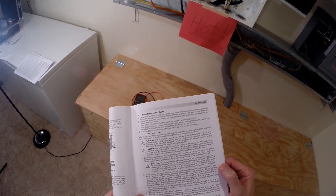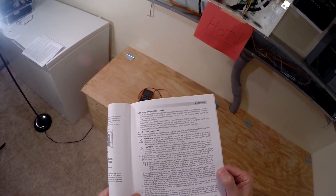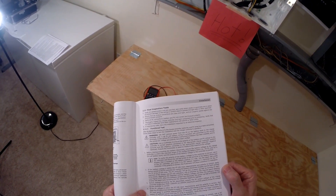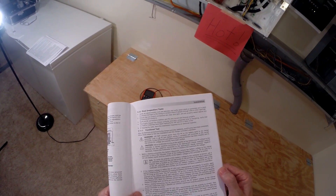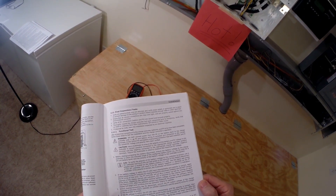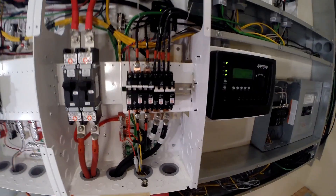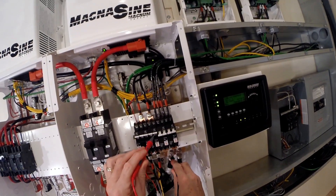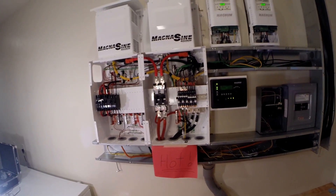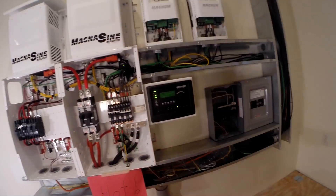From the manual: if the battery voltage, input requirements, and polarity are correct, apply battery power to the charge controller. The controller will go through a power-up test, turning on each segment of the display and all LED indicators, followed by the internal alarm beeping three times, then displaying the nominal battery voltage and software version. Before closing the PV disconnect, ensure the PV output voltage to the charge controller is less than the specified maximum — well, it'll be way less than that now since the sun is practically down. It's reading 155 volts but not much power. I'm not sure I want to do this while it's still charging off the line.